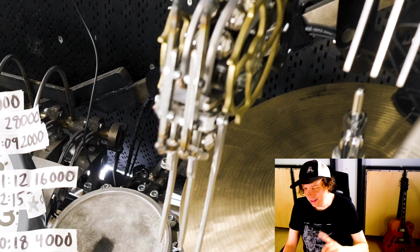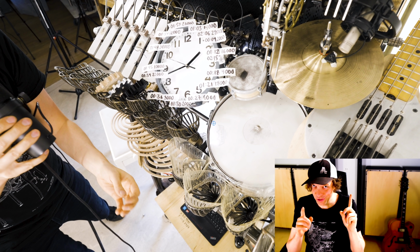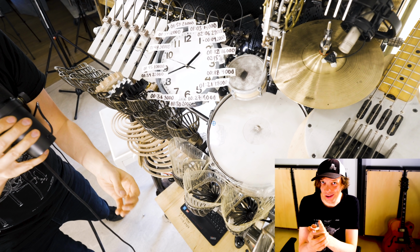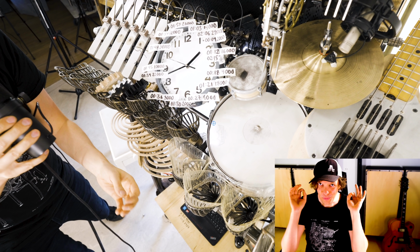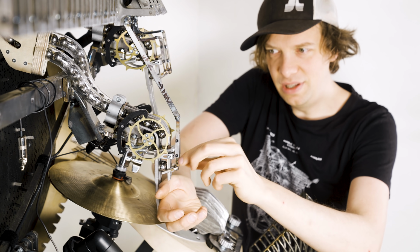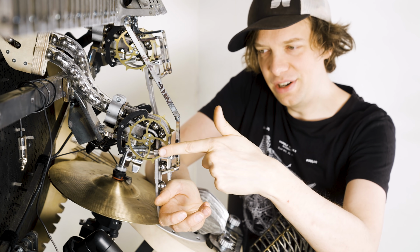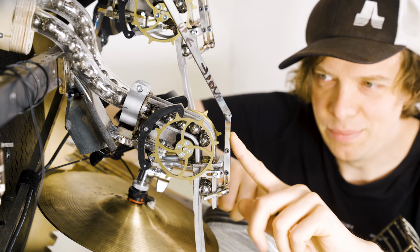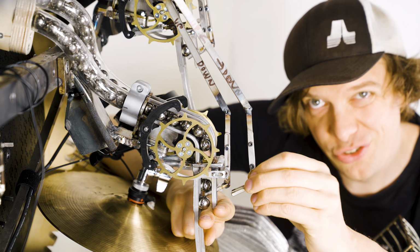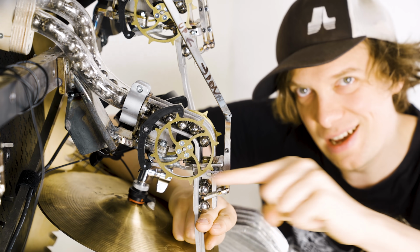I know exactly why this happens, and I know exactly how to fix it. I'm going to rerun the whole test again to see if we can drop 30,000 marbles with perfect result. This arm that is lifting out and pushing back in is not pushing hard enough. The issue is not with the mechanical design, it's just a matter of force of this long arm. I'm going to make this arm push stronger in. I'm also going to make this sliding part slide easier.